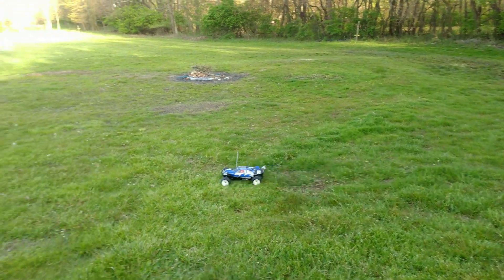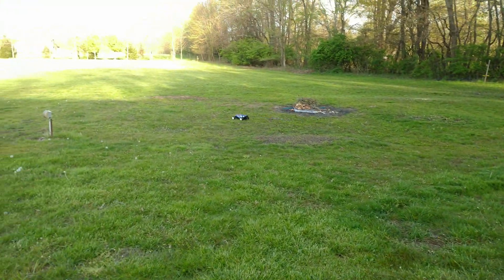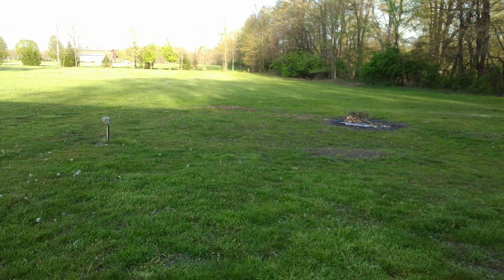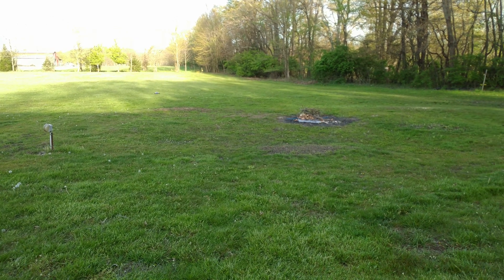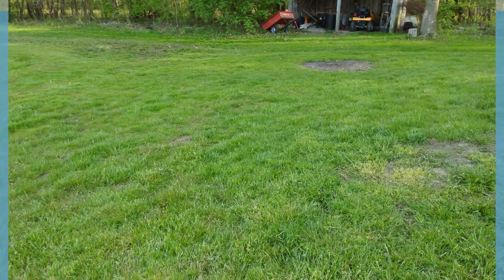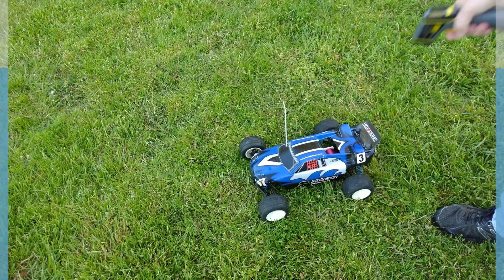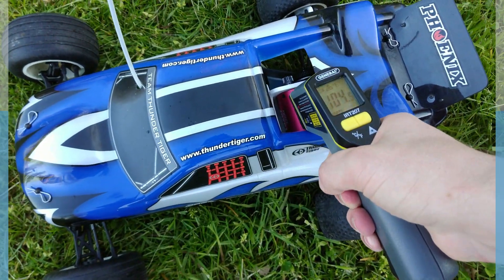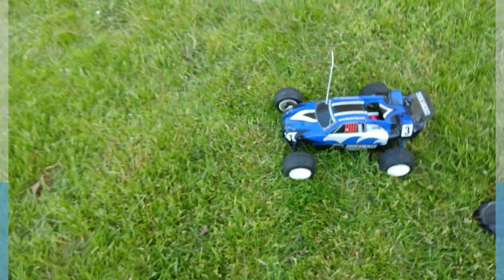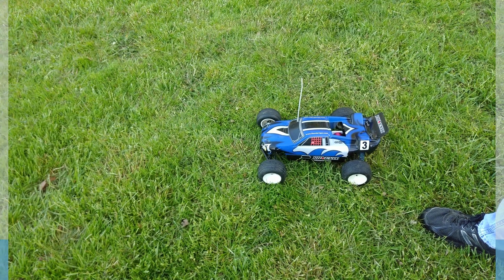Can you just punch it? Just once? Yeah, I suppose I can drive. It's full throttle. That's not very fast! Well, this thing in ideal conditions does 21 miles an hour. Let's get some footage here. What's the motor temp? Yeah, it's not heating up at all — so it's still under-geared. This thing has plenty of torque. It's under-geared. Probably could get it up to 25 miles an hour with some tuning.